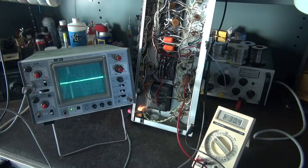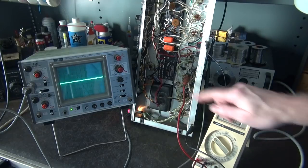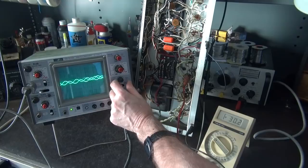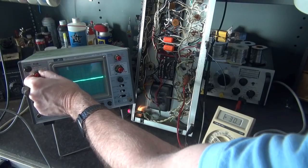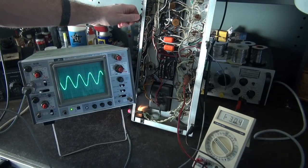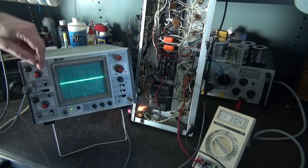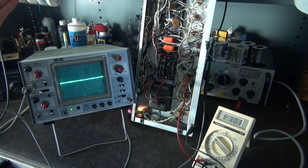Initial test — I've got my audio generator hooked up, still monitoring bias around 30 milliamps, scope arena over there. You can see there's a bit of a noise floor on the amp — that's not a good thing. You see that little ripple? I bet we've got bad filter caps. But at this point I just want to see if it's working. We're fired up. The audio generator is going into the vibrato channel. Let's bring up the volume — got us a signal, looks pretty clean. The amp is on, the tubes are biased, and they're not cherry red hot.